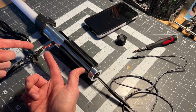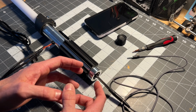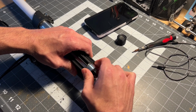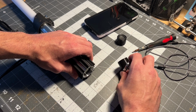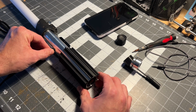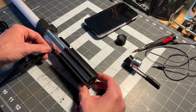Just like I talked about with these wires, with this one right here, again, be careful. It's got some E6000 adhesive in there to help hold it in place and give it some strength, but you don't want to go yanking on it. But for this demonstration, I'm going to put the little speaker pod back in. Before I do, I'm going to take the chassis out just ever so slightly, show you the inside. There's the little pad that the speaker connects into. Now, if I feed this wire in here a little bit, you can see the chassis starts to come out a little bit there. And your Crystal Focus X and all that stuff is down inside there.